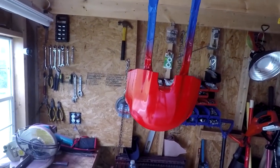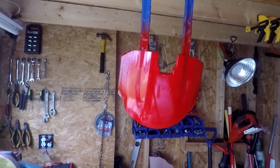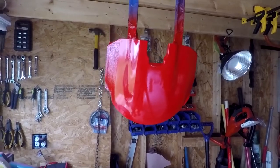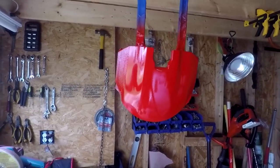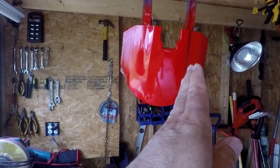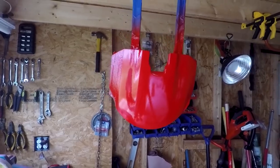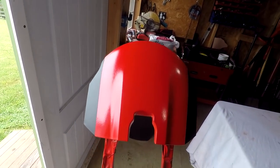That's two coats. I'll show you when it's finished with all the tape off. It's real easy — just prep it, sand it, wash it real good, get all the dust off, tape it the way you want. Then do nice light distant coats about six or seven inches away. Not too far — you don't want more paint in the air than on your part. Keep it moving, do not stay still. Go back and forth — start before you hit the part, swoop across, pan across it. Don't start right on the part because that area will be thicker. Start out here and go across.